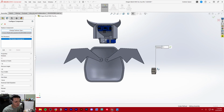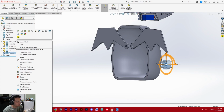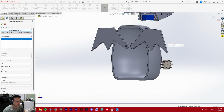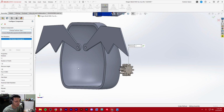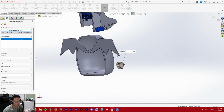It'll give you a gear. And then now in this little dialog window, you can just type in the specifics of what you want and it'll output and update the model of the gear for you that you can use. Okay, so if we open up our gear, you right-click it, and then you press Edit Toolbox Components, you're going to get a couple of options that basically help us pick what type of gear it's going to look like. So module is basically the size of the gear. It takes in proportion the diameter of the gear divided by the number of teeth or something like that. I've already picked gears that already work, and I'll just show you how to change it to that setting.